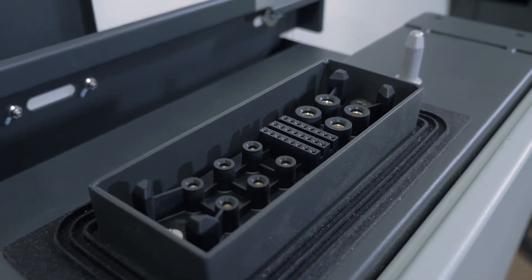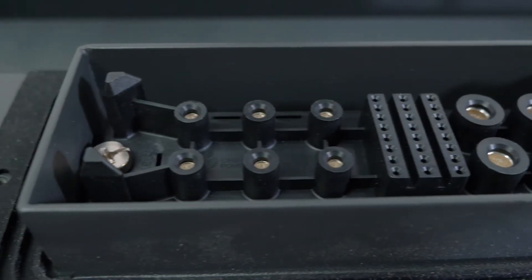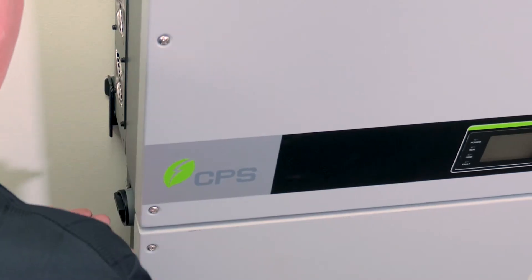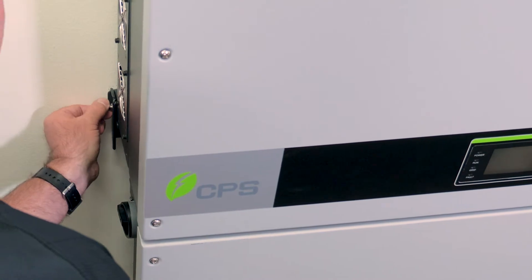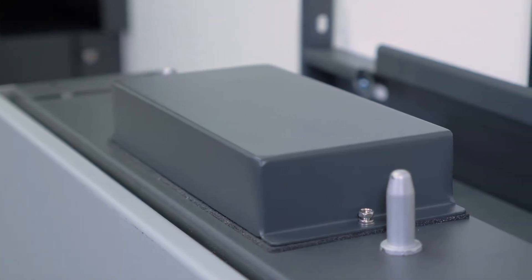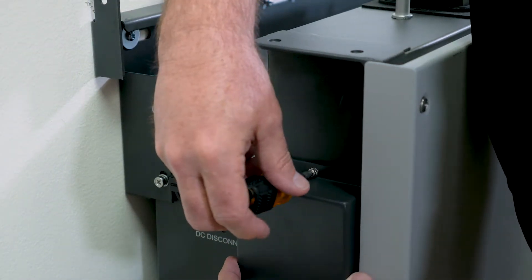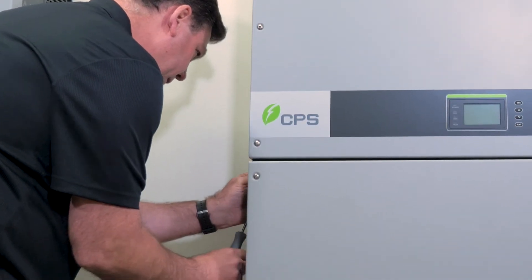The top of the wire box and the bottom of the inverter are mated by a connector. When the inverter is mounted on top of the wire box, no wiring between the units is needed. Simply seat the inverter and secure it with six screws. A trained electrician is not needed for this part of the process. Each enclosure is shipped with a cover over the connector. Simply unscrew the cover and attach it to the storage location provided at the side of the units.